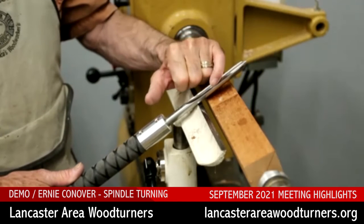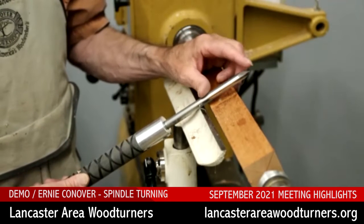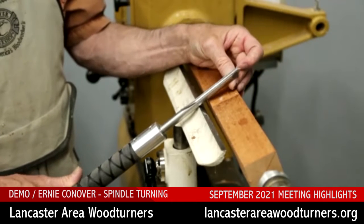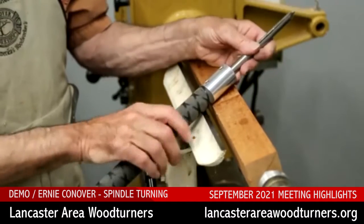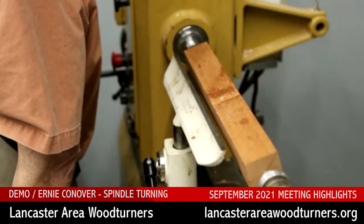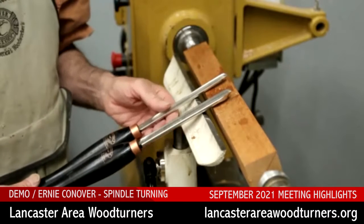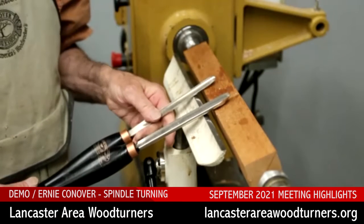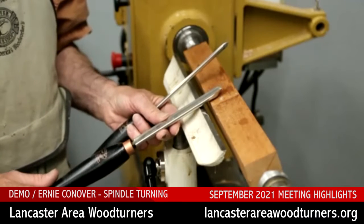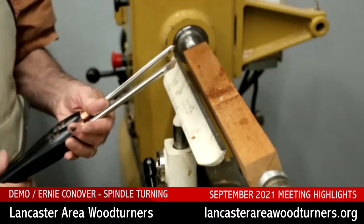And the detail gouge has a bit of a shallower flute than a true spindle gouge. And that allows you to grind a longer angle and get more sweep to the fingernail. And I like this gouge, and I like the handle. It feels very good. And that you can remove it to sharpen the tool is a nice feature. And these are two new tools from Crown that are much like tools that I used when I was a boy that came from Sorby and so on. And I find this one really nice for architectural work because it's nicer for sweeping bigger coves than a 1/2 inch gouge.